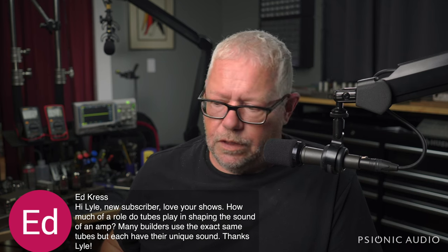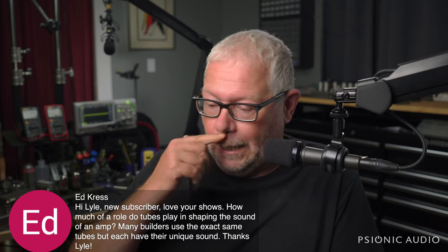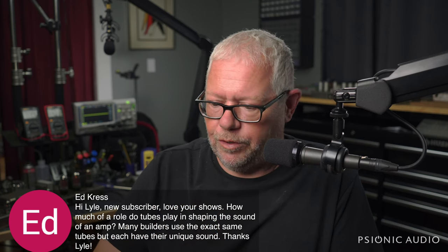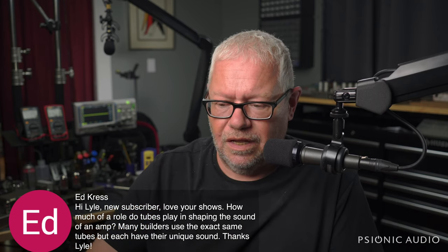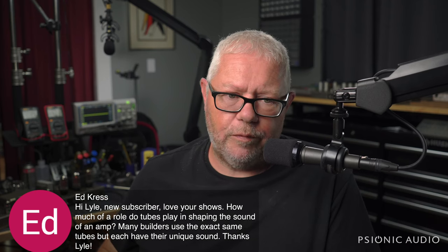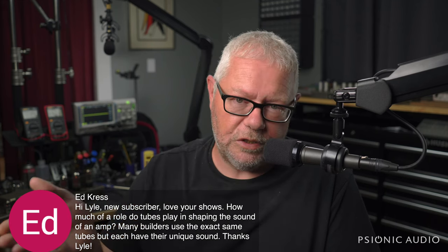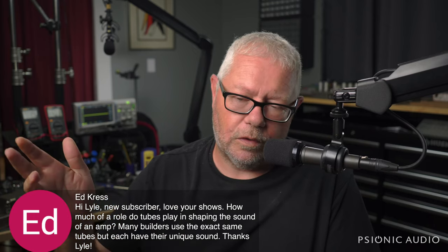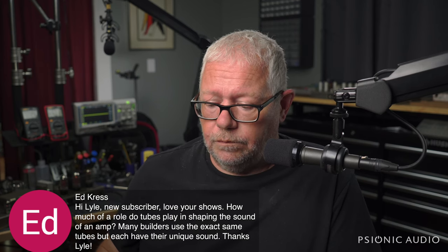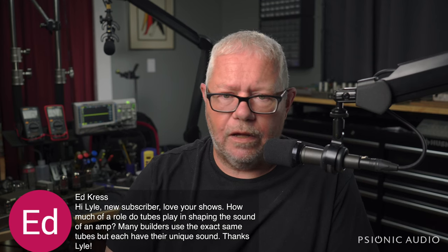So the tubes are not that different from each other. They are different. They have some different responses. And in certain applications, you might hear more of a difference between them. How do they react with a cathode follower preceding them, like in more of an Ampeg circuit? How they work single-ended is going to be different. But in how most guitar amps are used, there's a lot of baggage from the amps that they were first heard with that's associated with that tube. So people have a perception of a tube which is not always really what's happening within the tube. Now, an EL34 does have a different midrange response than a 6L6, which typically can have a little more high end, and a designer can bring that out, or a designer can work against that. Choose the designer, not the tubes. And if you like the way it sounds and plays, you're right.